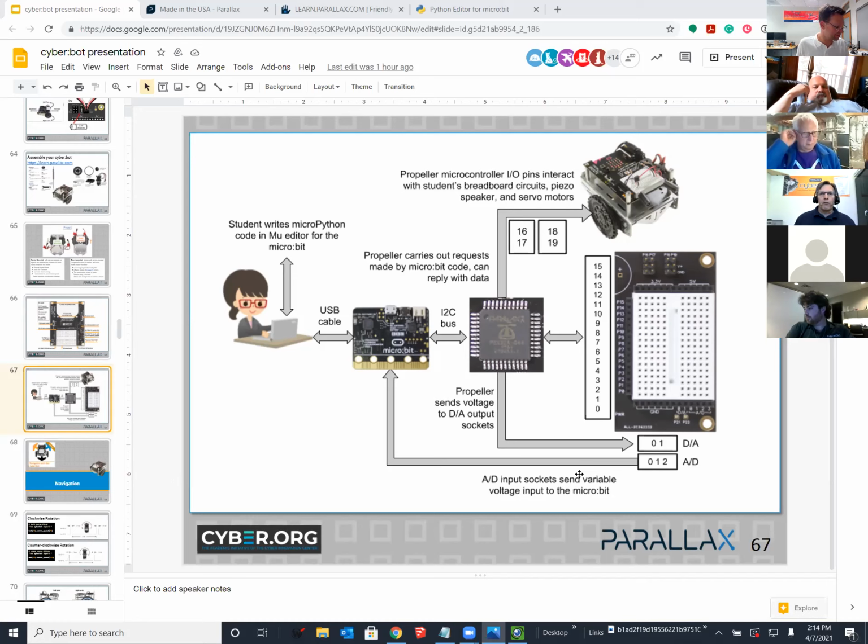So what we have right now is this patch where the new micro:bit module that Ken gave you the link to has a built-in sleep 500. So it basically waits half a second. And because of that, the message does not get missed. Now, exactly why this is happening on the V2 but not on the V1, I'm not sure yet, but I'll be spending some time on that.